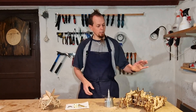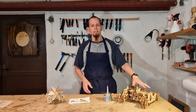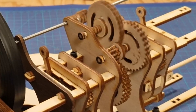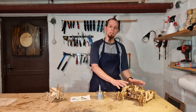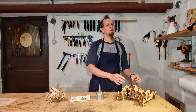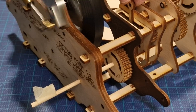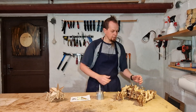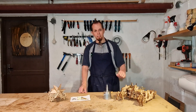So in this video I will show how I designed this strand beast. It is much bigger, much sturdier of course, and it has space for all the extra fittings. It also has some gears - a reduction gear system because the oscillating engine runs quite fast, around 600 to 1000 RPM, and I don't think that if I have a machine with fire, steam and wood that I want it to run away. So I have a reduction gear system and also a gear system where I can change the legs to move forward or backwards, and it's split between the two sides so it can probably turn as well.